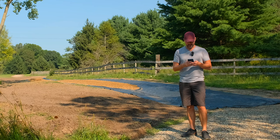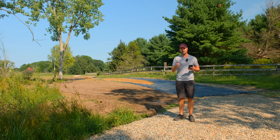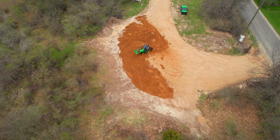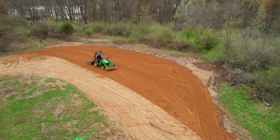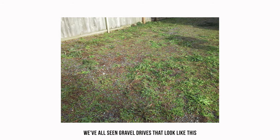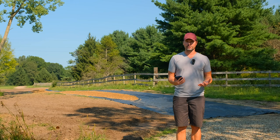This article is from House Digest - five pointers for maintaining your gravel driveway. Number one: deal with the weeds. Weeds can allow a driveway to get out of control. We did an expansion on our other property, widened a turnaround with gravel, and that stone didn't get packed down or driven over much. That lack of traffic compaction allowed weeds to come up through it like crazy versus the remainder of the road that's been packed down tight.